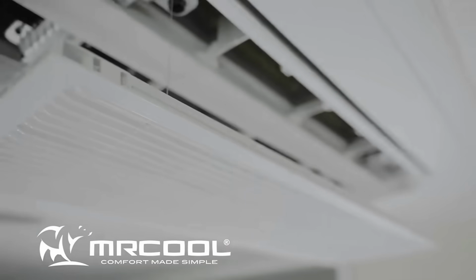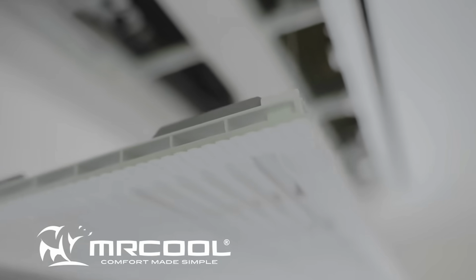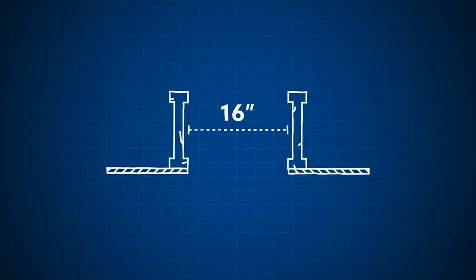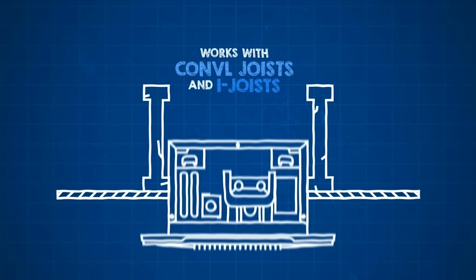Now the ceiling unit I'm putting in the attic is aptly called the Out of Sight, because once it's installed, it's pretty much flush with the ceiling. And it's got this really cool retractable filter so that you can easily get to it and clean it whenever you need to. And these are small enough to fit between standard 16-inch floor joist spacing, which means you can pretty much put them anywhere.